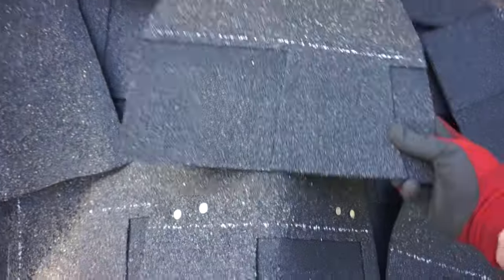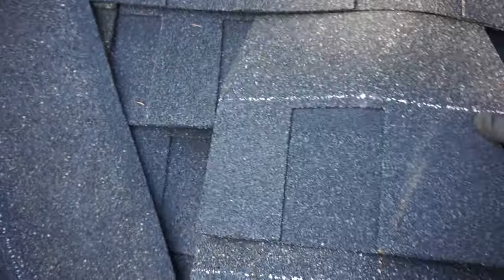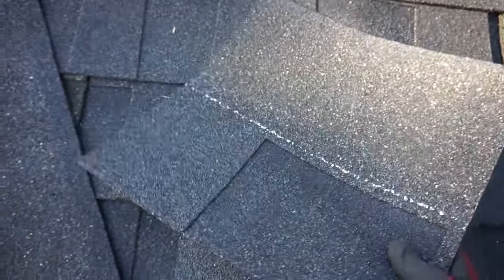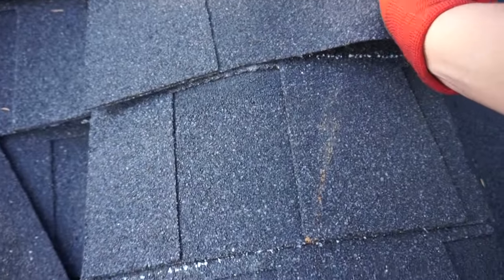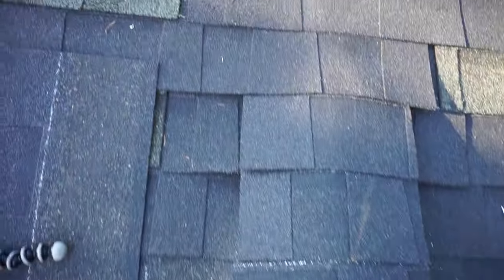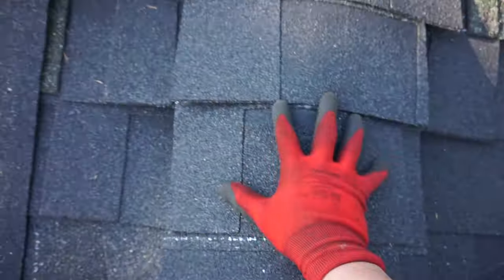What you're going to do is put that piece in, tuck that in like so — same thing. Next one, tuck that in, nail it. The very final piece, you're just going to mesh it in just like that, nail it, and it should come out flush like that. That should create a watershed effect — drip down to the valley — and you should be good. Make sure you nail underneath this side and you should be good.